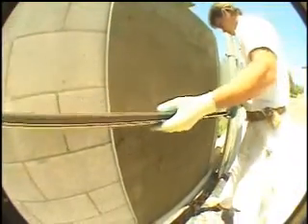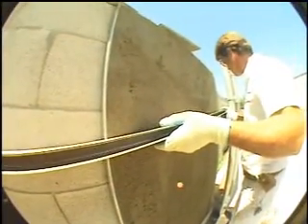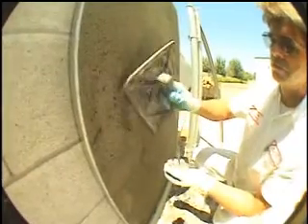It's a good time right now to shave it down — gives you ample time without working too hard to level it out and get it right to perfection. If we let it take up too much and get too dry then it'd be difficult to do. You start really scraping it and you're working yourself too hard. Right now you catch it at a good time — that mud is real cooperative and you're able to shave it down and get it right to where it has to go. If you want to fill in some voids, just take a little mud and put it right back into place.